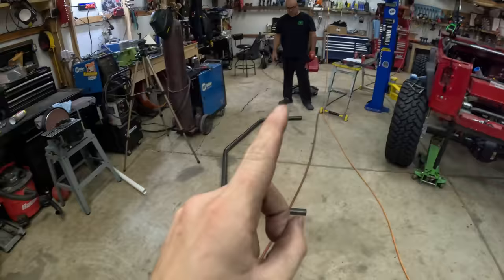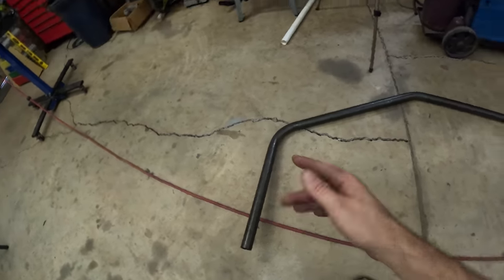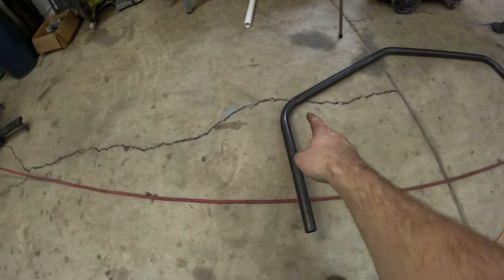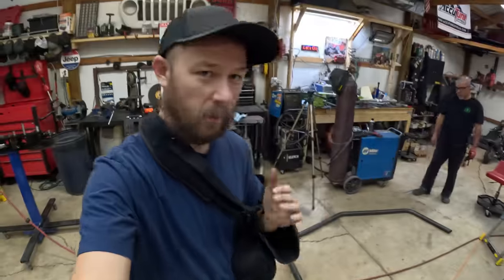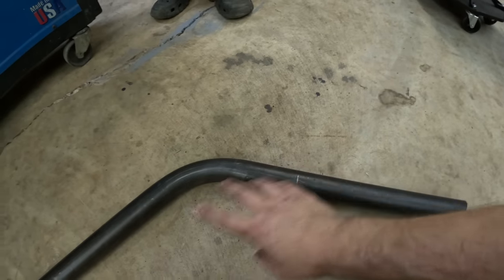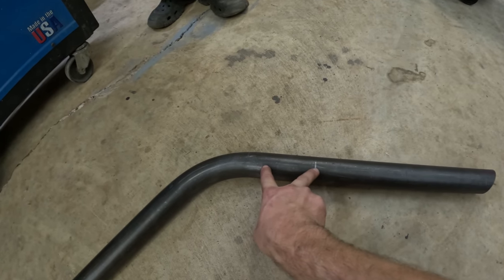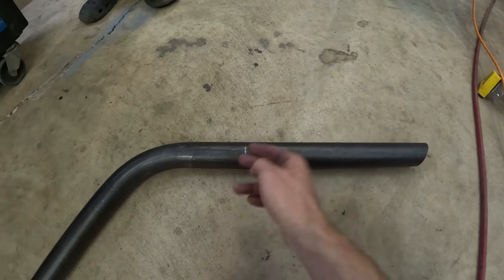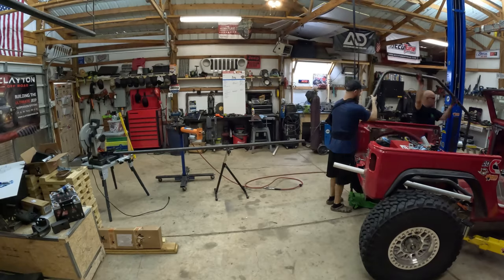Before we start forgetting where we did all the bends we're going to start on the passenger side and make an exact duplicate, just on the opposite side. The only difference is that 10-degree offset kicks out the opposite way. So visually: 60-degree bend, 35-degree bend, then 68 degrees with the 10-degree kickoff. To make it easy we scribed where we put our bends in the bender - every bender is different but mark your bender: in our case it's three and seven-eighths inches to the beginning of the bend on each one.